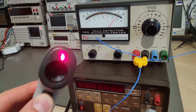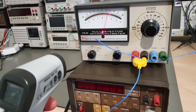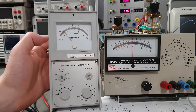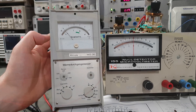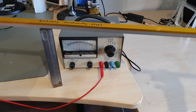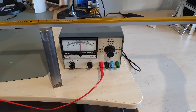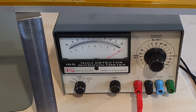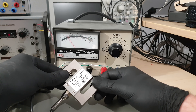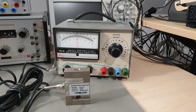It's so sensitive that it can detect the heat of a normal red laser pointer. I've shown something similar before with a certain heat flux meter - also an interesting device - but I don't like how it tries to lure you into physics by giving you something as absurd as kilocalories per square meter hours. Just good old microvolts will be fine for me. These are the microvolts over a thin piece of wire caused by a constant current through it, changed by an ever so gentle stretching - that's the fundamental idea behind strain gauges and load cells. This chunk can measure forces equivalent to 300 kilograms with the same deformation sensing technique.